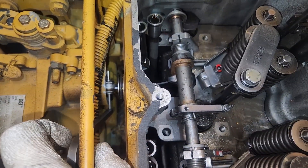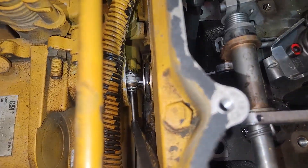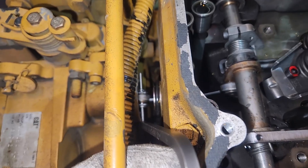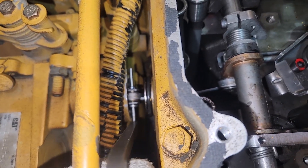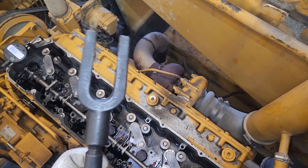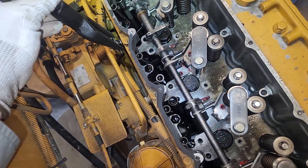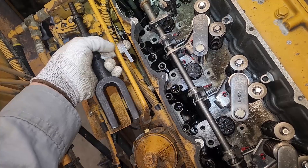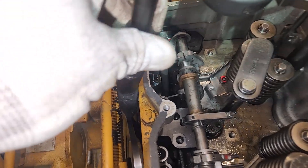Now what we're doing is the fuel setting. To do that, you have to slide that tube back — it goes between the governor and the head. Then you need this tool, which is a pin. That pin is going to pull the rack to fuel high position. There's a special fork tool — this is not it. This is a pickle fork. The special fork tool is with our missing tooling somewhere. So we're going to adapt and overcome. Luckily, we do have the pin tool. The pin tool goes through that rack rod there.